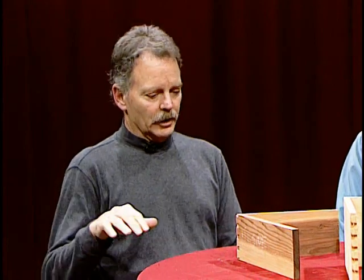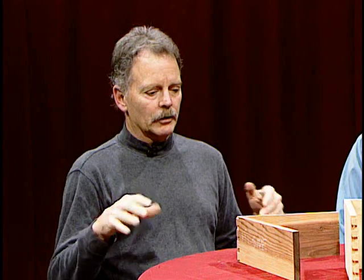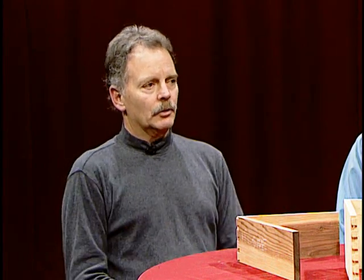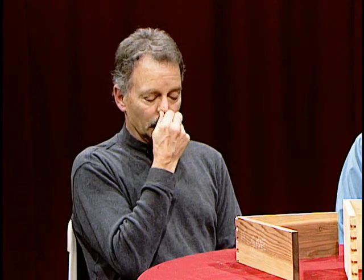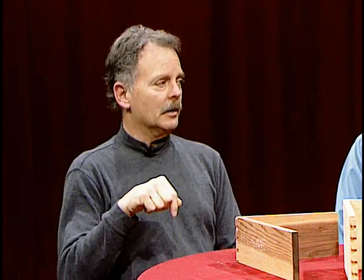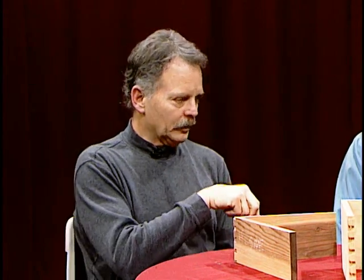When they're done commercially, you'll have a gang of cutters that cut them all at the same time, and the machine is set up perfectly to do that every time. But for a small shop like ourselves, or anybody endeavoring it, you'd probably have to cut them one at a time and shift the part that precise distance each time you cut them, and it's a supremely challenging operation to do.